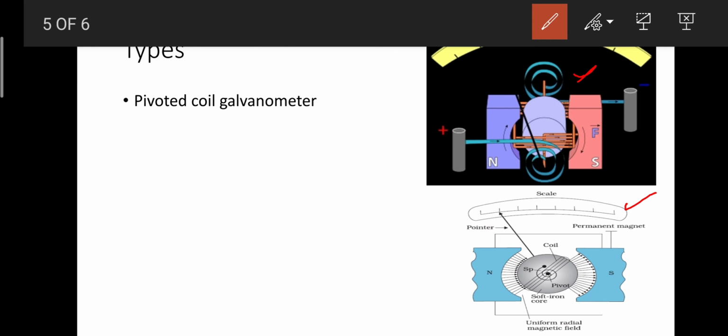So because of that, the needle which is attached is going to be deflected, or you can say it is going to shiver from one point to another point, right? Definitely it is not coming to rest, because the coil inside the galvanometer is not at rest. So it will shiver, and it will be time consuming to wait for the needle to come to the rest position and give you the accurate measurement of the current. This is the major drawback in the lamp scale arrangement.